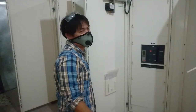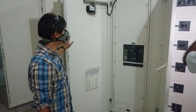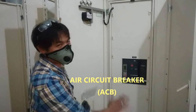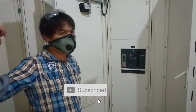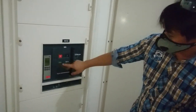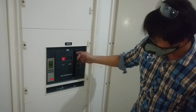Hello guys, we are here in Building 109, main electrical room. I'm going to demonstrate how to operate the breaker manually. This is not energized — still de-energized. Tomorrow we are going to energize from the transformer side. As you can see, this is the spring charge off position — you cannot push it on manually. You have to charge the spring by using this lever.